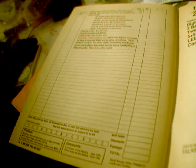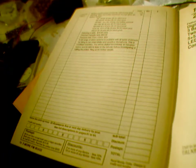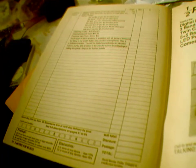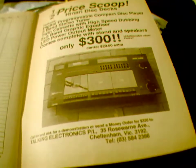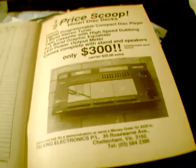So have something that's got a tapped coil. And the really good crystal sets have impedance matching between the antenna and the tuned circuit, so you can get really good power transfer of the signal, which is really important because signal level is absolutely critical with a crystal set.